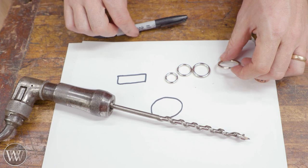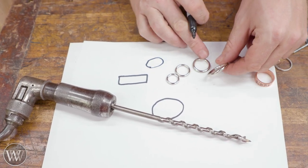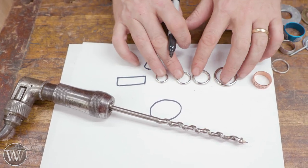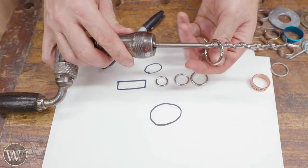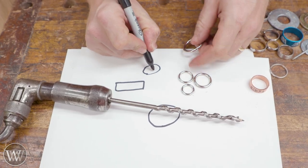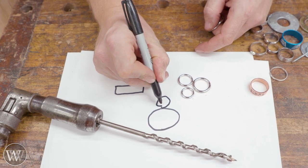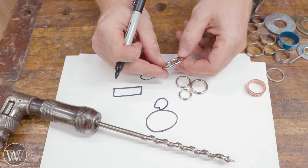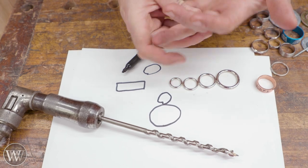Then I found rings with a perfectly circular cross-section, some a bit larger. I thought this would be exactly what I wanted, so I ordered a bunch in four different sizes. But when I tried them, they also rotated way too easily because there's just one point of contact. If the ring is riding on top of the shaft, it's touching at just that one point, and that's not enough — it just allows it to twist freely. These gave a lot of erroneous measurements.